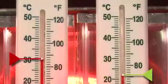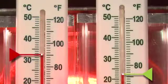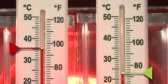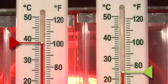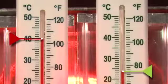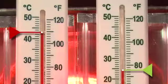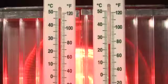While the temperature on both rises, the temperature rise on the panel upgraded with the heat reflecting sheet is much slower. The heat reflecting sheet is excluding 85% of the heat. More significantly, the temperature on the ordinary polycarbonate continues to rise to beyond a staggering 49 degrees centigrade — 120 degrees Fahrenheit.